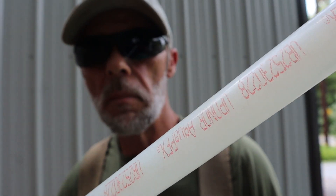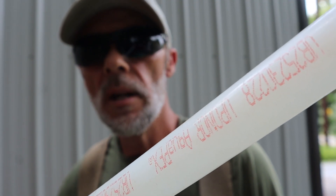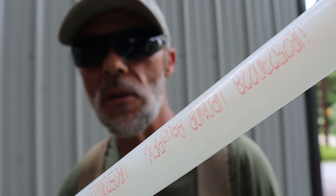Over on the south end of the building we have the utility room — it's got the washer and dryer, and the room next to it has a half bath. All that stuff over there has to come through and integrate down to the point where I showed you the dump for the septic tank. Now the type of pipe we're going to be putting in here at the cabin is a hybrid PEX known as Uponor. It's designed to contract and expand under weather conditions and does not require any gluing or soldering. I have a special tool I'm going to show you how it works — it's really cool. Let's go ahead and get started running some pipe up underneath.